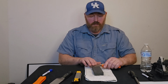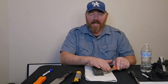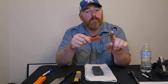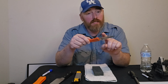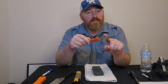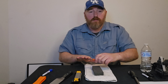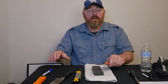But so I'm going to do this at the same angle. Now what's going to happen is when I raise that edge up, I'm going to see any place where there's still blue, I missed. If I'm going even along there, I've just taken that blue completely off. That blue is gone because I got a smooth pattern and I got it even across the entire edge.